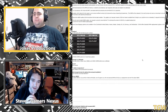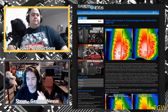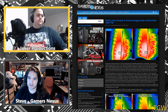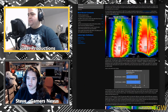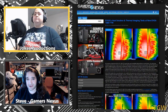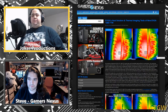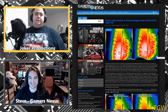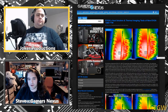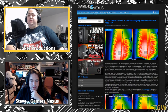The front side of the PCB between the base plate and the heat sink — EVGA provides a thermal pad that goes on top of the inductors/chokes, covering them and contacting the actual heat sink to dissipate heat. This issue appears largely resolved with both solutions. The other cards — super clocked editions are likely not affected, but some higher-end ones may be. Some SC card owners have reported black screens, which they now realize may have been related to this issue.